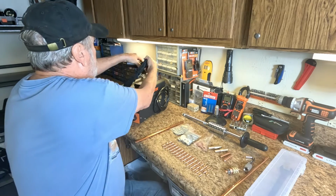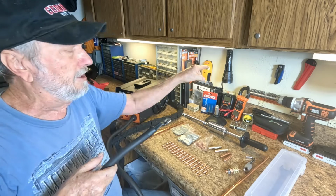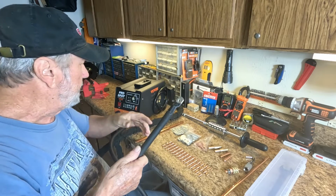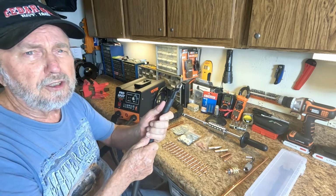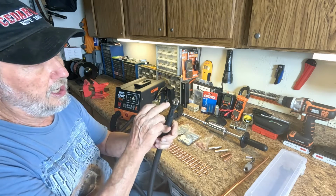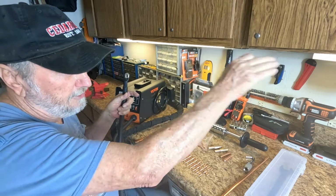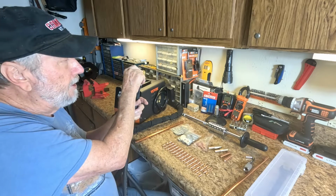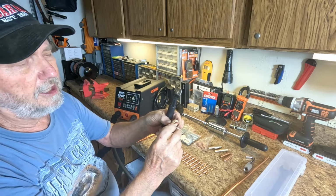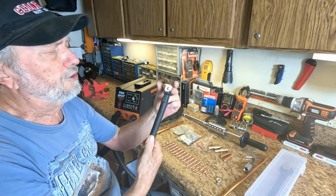Now, this is a very valuable little deal. With the welder cords, you get the ground. This is going to be the positive, which is going to deliver the controlled power of current that is going to do the welding. But it's got to have the ground on there connected to the metal strip or the fender, wherever you're working. And you have to grind down any place on there that this is going to connect to. You would drill a hole. Now you'll have to fix the hole later. And this should be placed as close to the area that you're working. If the dent is in the side of a door, then you want this in the door at a point away from it. And you'll drill a hole that you can screw this in. You take a drill bit a little less than this, and then you'll be able to screw this in and tighten it down, but this will go just like this. So it's your ground connection.